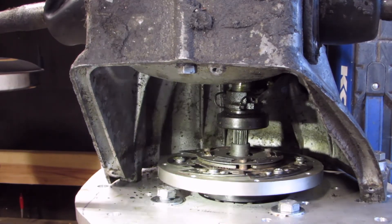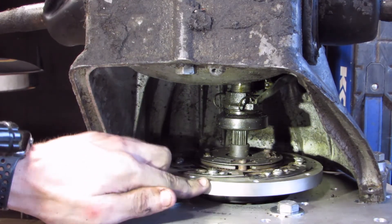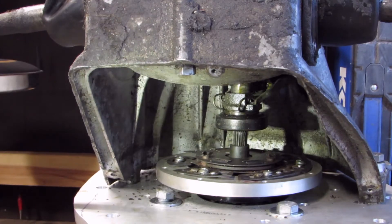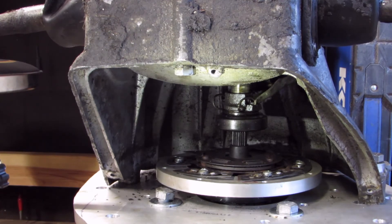I've got the battery hooked up to the motor and we're going to give it a test run. I had to put the motor flat on the ground and then put the transmission on top of it — that way I could make sure the splines are perfectly centered, then remark my holes. I'm going to bring it all down to the floor where you'll be able to see the actual transmission shaft spinning with the coupler, because I have the bottom plate off. Here's the transmission on top and the electric motor on the bottom with the coupler plate. You can see the splines are nice and centered in there — I can actually move it by hand. I've just got an easy switch attached to it and I've put it in a gear, so we're just going to go for it.